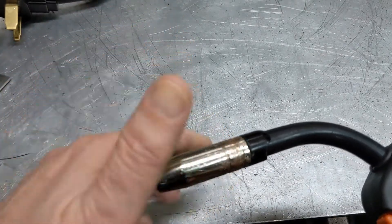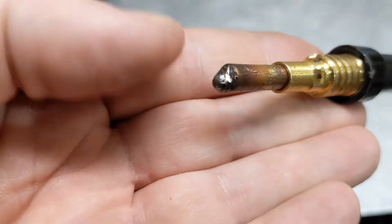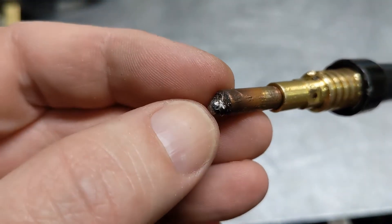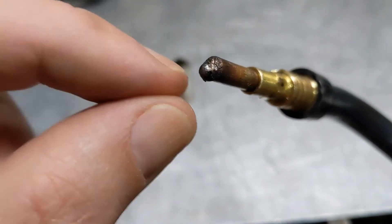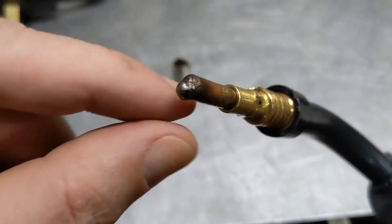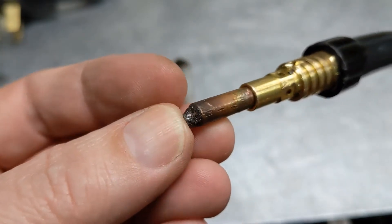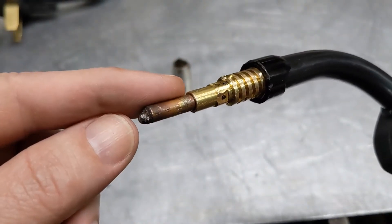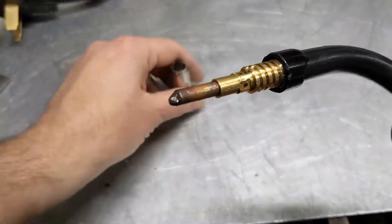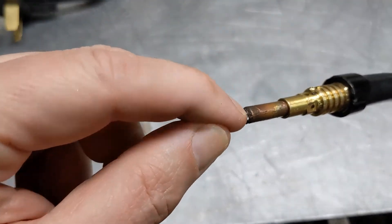This is not supposed to be like this — this is missing a spring here. But if you take a look at this tip, I don't know if they're copper or some sort of an alloy, but the idea is they're made of something that the steel shouldn't stick to. Oftentimes when it burns back it will make a little ball and stick to the end here, but usually you can grab onto it with a pair of pliers and break it free. This one, you can see it just fully welded the wire right back onto this. What happened is this was running at too high of an amperage for the wire size, and when somebody let off the trigger, it was still hot and burned back into the cup and had enough heat that it just welded to this tip.